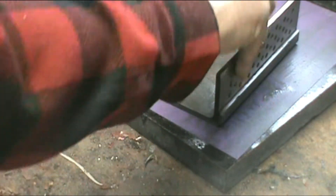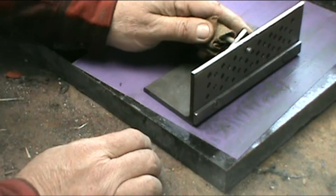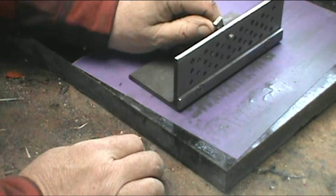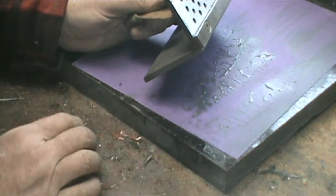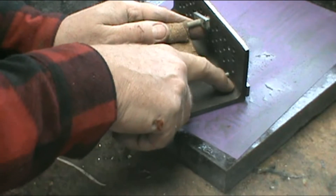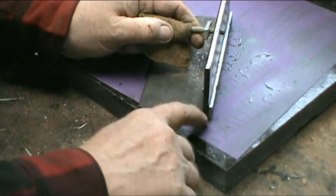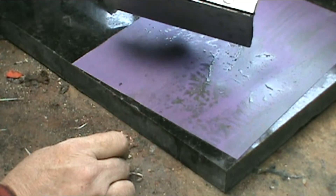This is an extruded product and it's extruded at extreme temperature, so any little bend or warp in it stays in it when it cools. They're not in the business of heat and beat — they're in the process of extrude and go. If it was bent, this outside corner right here would be round and the inside corner would be squarer. They used a rounded die on the inside to relieve stresses — so it doesn't come in square and create two close stress points that would give a break point.